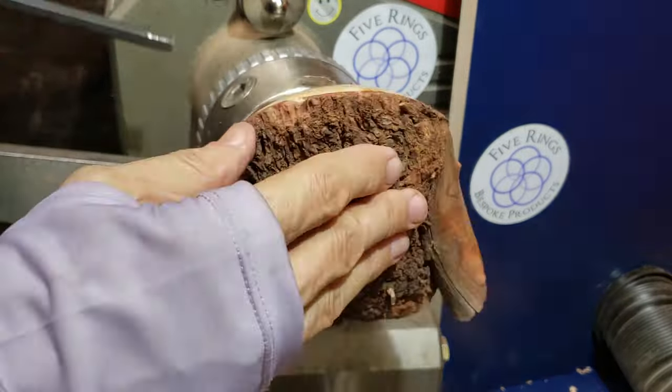You can see there's a little bit of torn or fuzzy grain in that lower right hand corner. Not too worried about it. It's pretty soft and not deep, so it should sand out pretty nicely. This little bark inclusion next to the branch was a little bit weak and crumbly, so I did reinforce that with a little CA glue, and I was starting to get a little more worried about the branch because it was bending pretty significantly, and I was hoping it was going to survive the sanding.